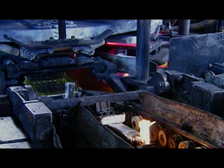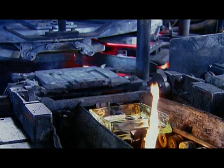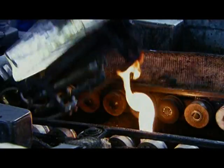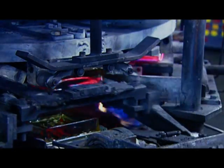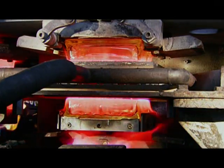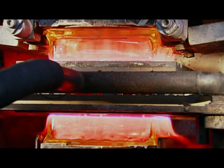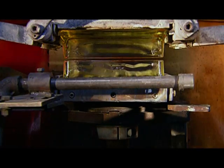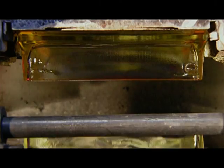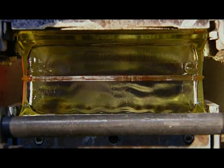This is where two half blocks join together to form a full block. Entering the machine, each piece passes over a series of burners that keep the glass temperature constant. Sudden cooling could crack or shatter the glass. The machine then slowly reheats the half blocks until their edges start melting. They enter the part of the machine called the squeeze station, where an automated press forces a top half and bottom half together. Their melted edges fuse, forming a single block.